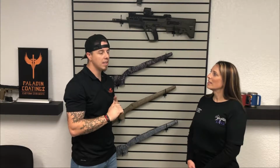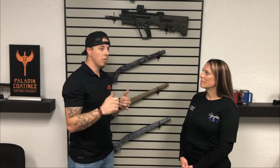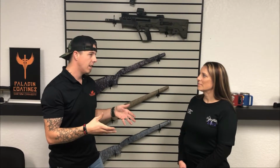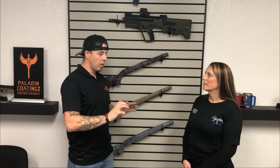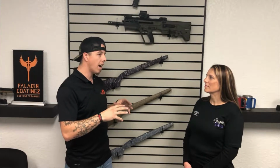So you kind of answered my next question, which was what is the process? Yeah, so basically the process of doing the Cerakote is we bring a firearm in here, and whether it is from the factory or from just sitting around at your house for so many years, we'll take it apart, degrease it, clean it, get all the factory oils and the cosmoline off of there. We do that in our solvent tanks, and then we'll put it in our blast cabinet that blasts 100 grit aluminum oxide onto the surface. So basically it removes all the old paint or parkerizing or hydro dipping or whatever it may be. We remove all of that old stuff and then spray it with the aluminum oxide so that it leaves a fine, smooth finish. And we blow it off with high pressure air so there's no dust.